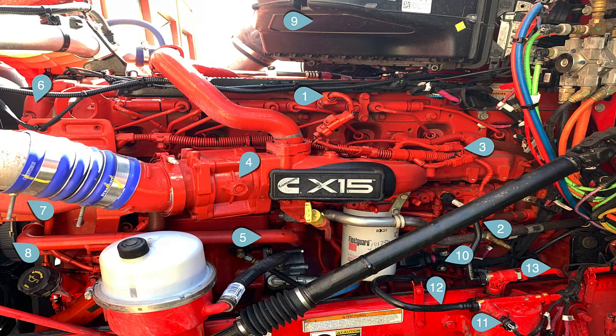Number nine is just an air filter, supplied by the OEM. They're going to a new cartridge type air filter. You put them on and don't change them until you reach your mileage interval, or when the air minder indicator tells you it's restricted enough. They don't want you taking it apart and looking at it, as it just causes dirt to get in there. It's pretty much a one-stop deal now — Cummins makes their own, but the OEMs have them as well.